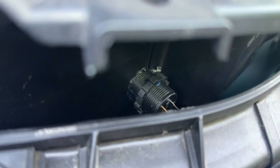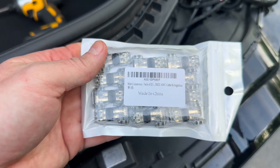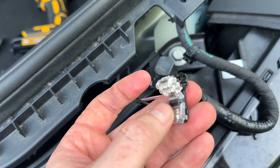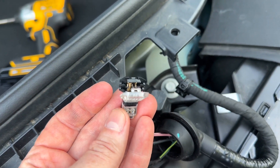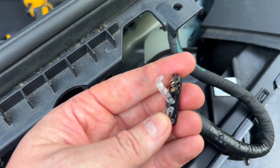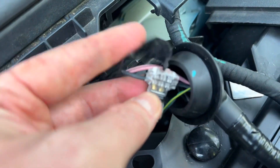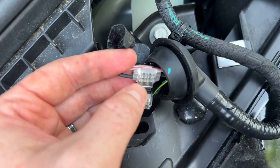On the back side, we have the two prongs from the device — I've still got to clamp it down a little bit more. After that, we're going to use these wire connectors that make it easier to tie into this wire. Basically these have two paths — one for power, one for ground. The top one is for the left-hand side, so I'm going to make that my hot, and then the bottom I'm going to make my ground. You tuck in the wire, line up the paths, and then clamp it down with some needle nose pliers. And boom — you have power to the circuit.